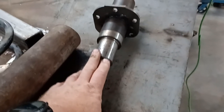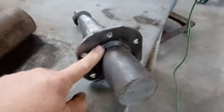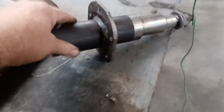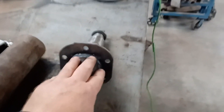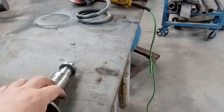This set of axle stubs I got on eBay. They're actually really well made — this is a solid piece that was machined down to accept the bearings and the seal. This flange has been welded on there and it appears like it was welded using a jig and probably some sort of a machine that did the weld. It's a pretty clean and even weld. This pair of stub axles was about $115. The ones with the grease fittings are more like around $150.